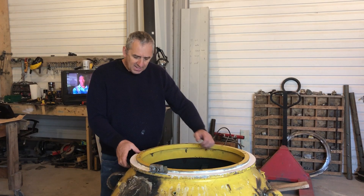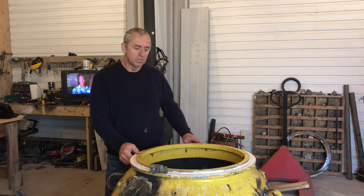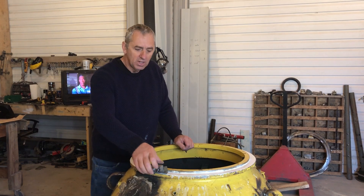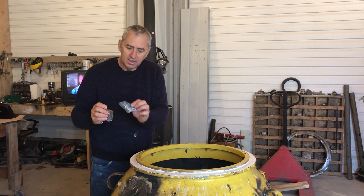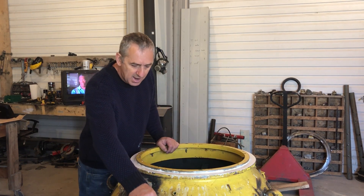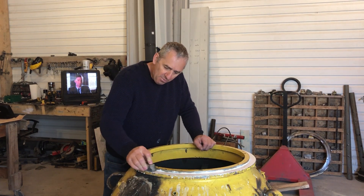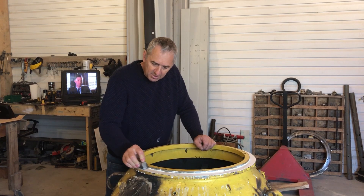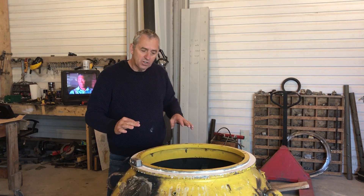What I've done is I've painted the seat with fiberglass gel coat, and then what I do is I have this perfectly flat steel block and I take wet sandpaper, starting with a rough grit, and I sand it very carefully and evenly. Then I set the acrylic cylinder on and I measure the gap.